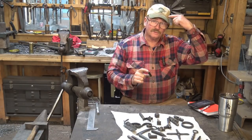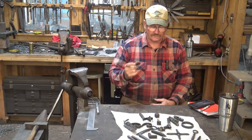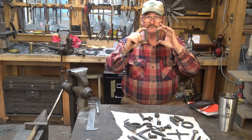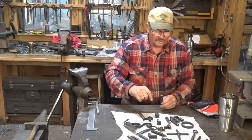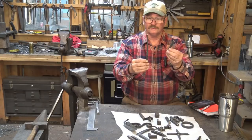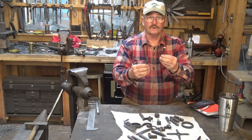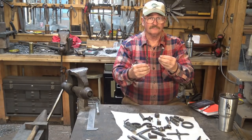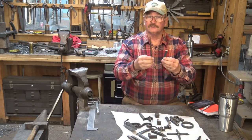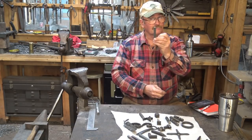It's this piece — using it to develop skills, come up with ideas, think out of the box. It doesn't have to look like it was made from this. Maybe we'll make an S-hook out of it, drawing this out to quarter-inch square bar first. In theory, a piece of half square has four quarter-inch square bars worth of material in it. So if it's three inches long, we're going to stretch that to about twelve inches — that's a fairly long S-hook.